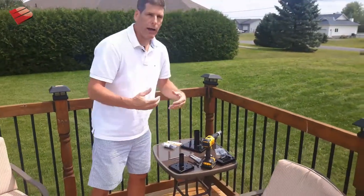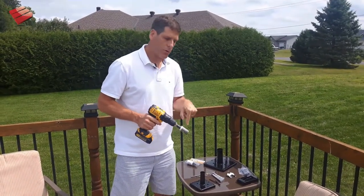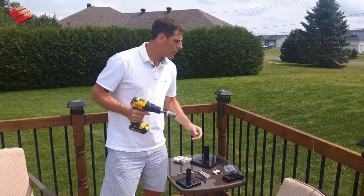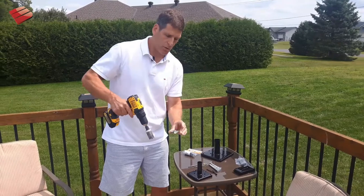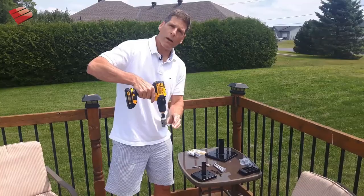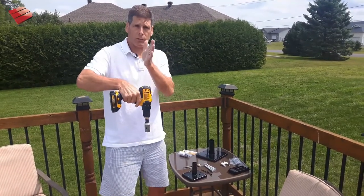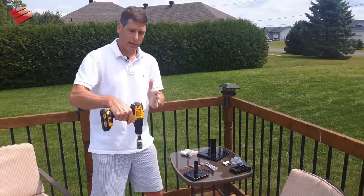Here's a quick summary on how you'll install this. You're going to take a hole saw — which is an inch and a quarter diameter — mark the center of the post, get the screw tip to line up with that center point of the diagonal, and plunge it straight down. If you're new and really uncertain, you can use one of these center guides. Butt it up against the corner of the post, and the three little vertical legs will hold the hole saw nicely to get it started. Once started, remove the guide and plunge it down, checking vertical by looking from two adjacent angles.